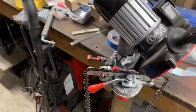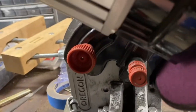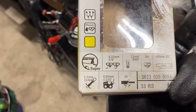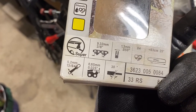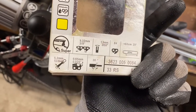Give me a second here and we'll go into how we set up the bench grinder. I'm back, getting around the bench grinder and I got the chain in here. First thing you've got to do, besides make sure you have the right wheel in there, is set your angle. A lot of the boxes will tell you what angle these go to, the size of the links and so on. It's 3/8-inch chain, tells you to set the raker at 0.025 — this is not safety chain.